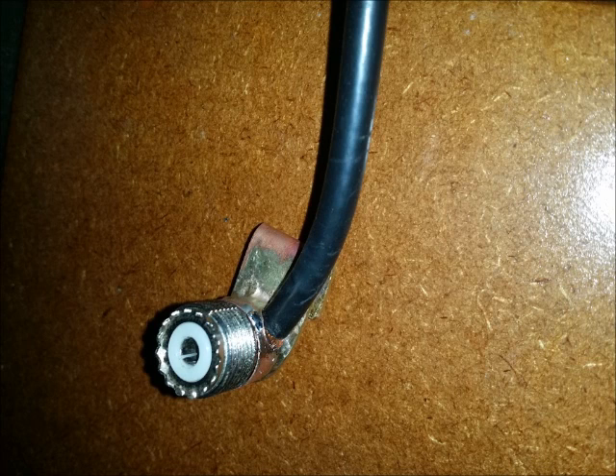The most difficult task was to secure that connection to the brass pipe that I had cut. If you try to solder it, the plastic piece in the middle starts heating up, melts, and it doesn't work. After trying different types of epoxies, it all came loose. The best solution was to use Gorilla Glue, which is a waterproof glue, often used for woodworking but also multipurpose. The special characteristic of it is that it expands as it dries, therefore pushing the middle piece tightly against the copper and securing it very tightly.